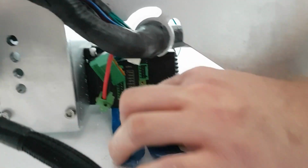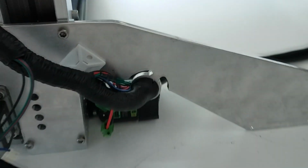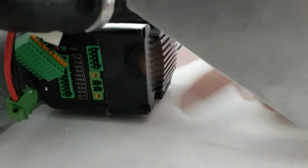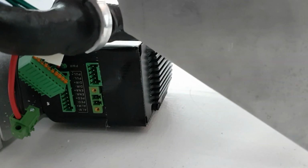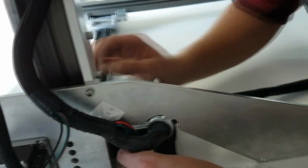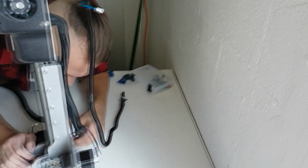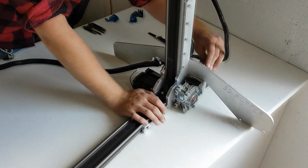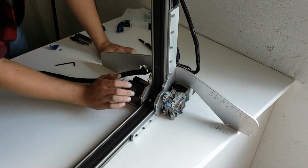It's important to only remove the protective masking tape that will either be a bright blue or green color. Do not remove the black duct tape on the motor. That tape is covering motor setting switches, of which there are 8, and they are on certain settings. If the settings of these switches are changed, motors could go in wrong directions, at different speeds, and even potentially burn themselves out. Please ensure that these switches do not get changed.